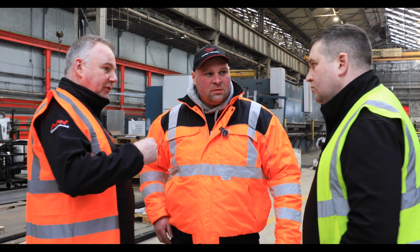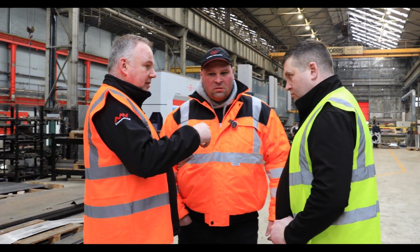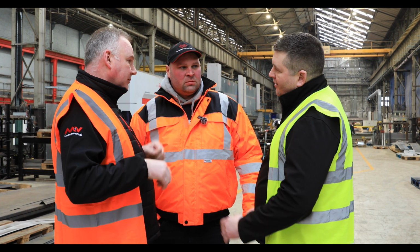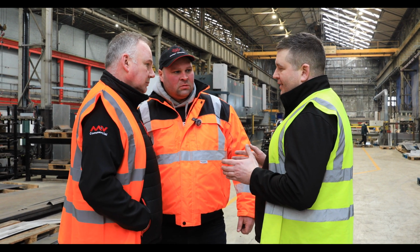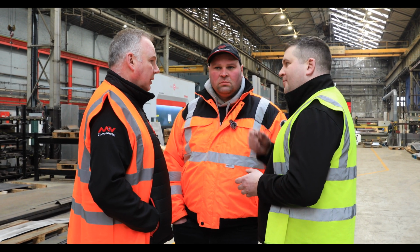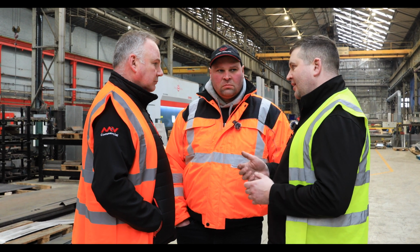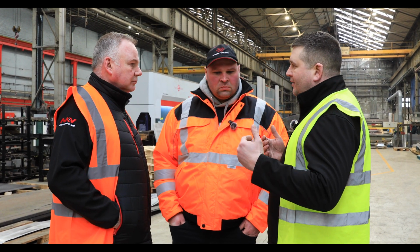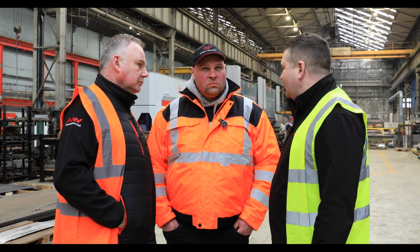If you have to weld two 6 meters, does that make it a bit weaker? It is. So you can make it strong, but then that will be a lot of welding and some extra parts, which probably will mean extra weight as well. So if you can avoid welding, it's much better all the time. Less welding in general is better.